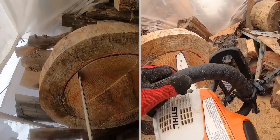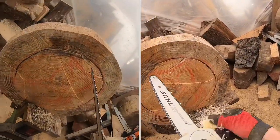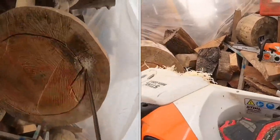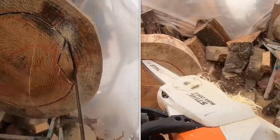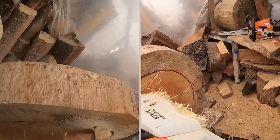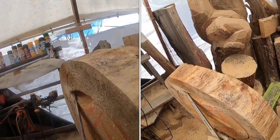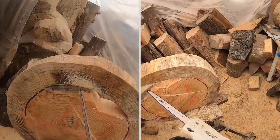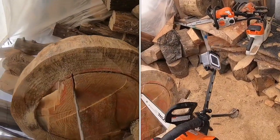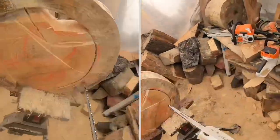We're getting an idea of what we want to start removing by putting that circle in, then outlining the owl — it's easy to goof up. I'm keeping the horns extra long so I can keep them attached to the upper part of the round. This could prove to be a bad idea because the round can dry out, crack, and pull his head apart — so you could detach those and have just the base of the owl connecting to the hollow. I did an angle cut up to the line because we want the owl to set back in the hollow just a little.